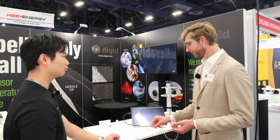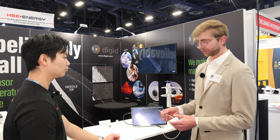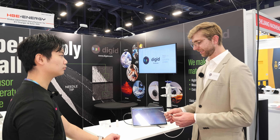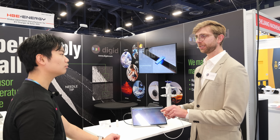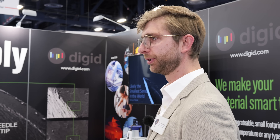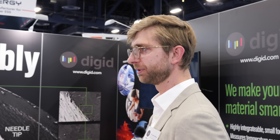This is how you can print one sensor. We could also do multiple sensors for multi-axial strain sensing. We can put a sensor on the spine of the scalpel or on the side. We could do full Wheatstone bridges for temperature compensation, or single Wheatstone bridges directly on the material or on a component — like foils, metals, any subcomponents, or silicon bridges.